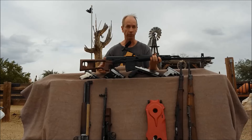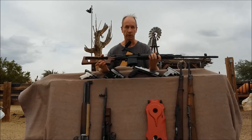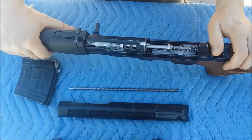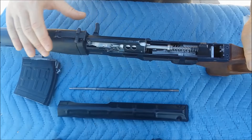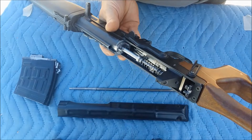There is an aluminum bolt carrier for this type of rifle. This was the CO2 variant with a pot metal zinc alloy bolt carrier, but the green gas variant — where the bolt cycles back and forth with each shot — has an aluminum bolt carrier. Usually you can buy these parts separately at big airsoft retailers, but at the time it was out of stock everywhere. And it would have been very time-consuming to find the sweet spot where the bolt is heavy enough and the bolt carrier light enough. So instead, I mechanically lock the bolt to the bolt carrier, and that happens with this spring-loaded lever at the end of the bolt carrier, which interacts with that slot in the bolt I showed you previously.